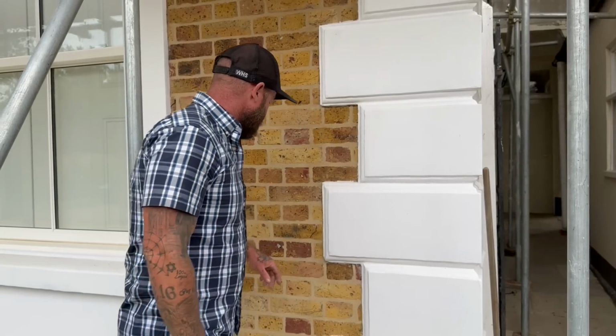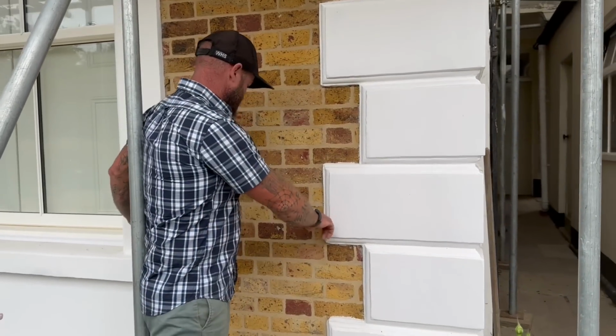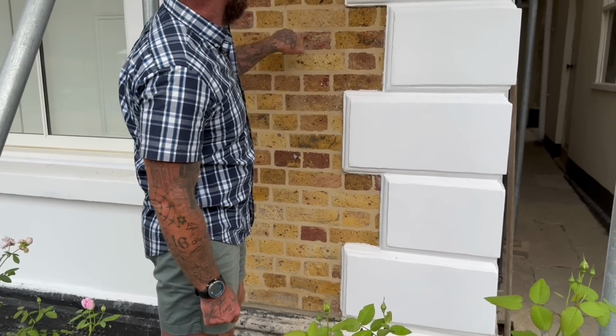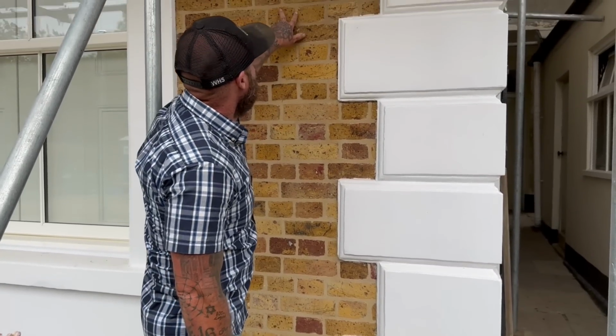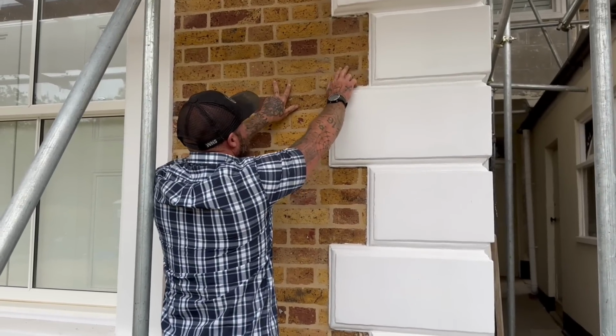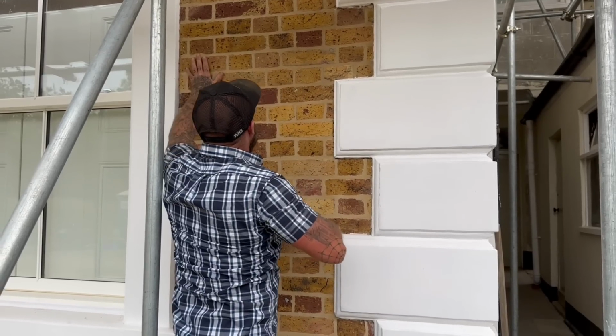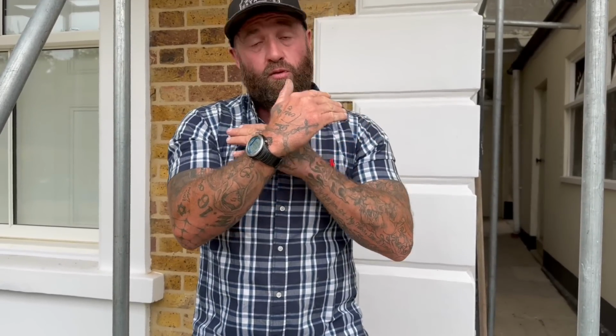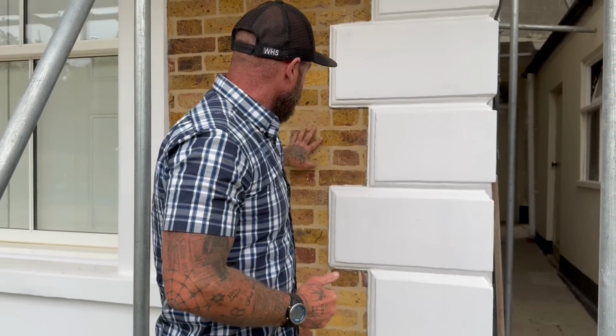Now, same in the Flemish bond. See the broken bond here, the given measurement, two headers, yeah? And as she steps back, it works back to bond. You see, header, stretcher. And he's moved it over to the reveal there. So it will eventually step into bond as the measurement opens out. So for example, if you've got a pier in between two windows, it'll always be two headers. Then when you go above the windows and through the build, it will go back to bond, and that's the statement. So I know the craftsmanship on here has been fantastic.